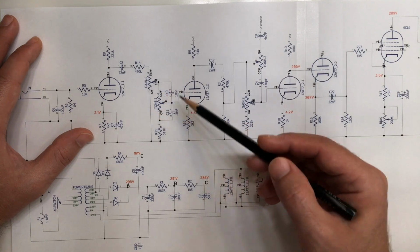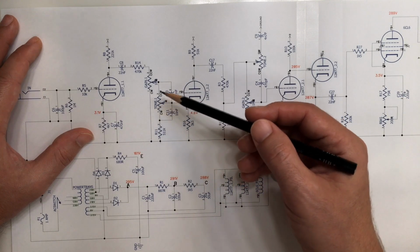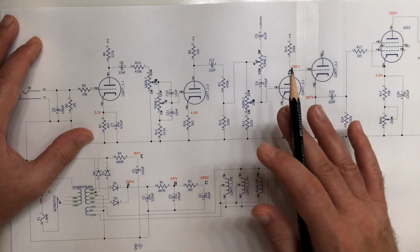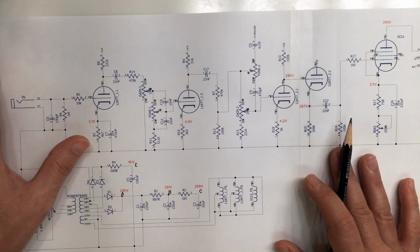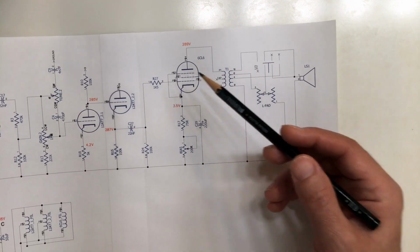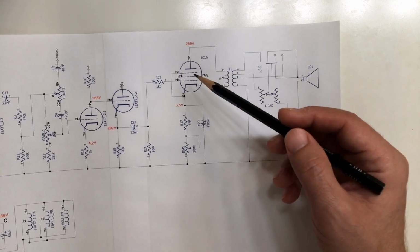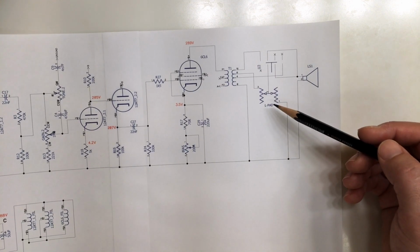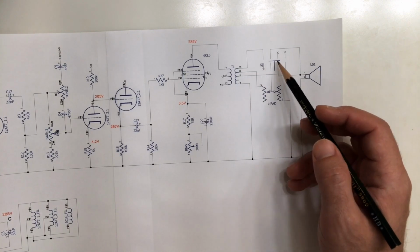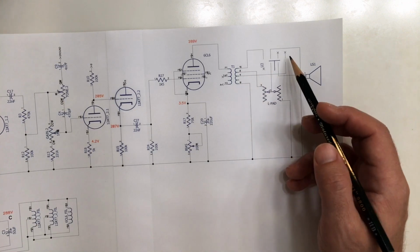This is done so that we can have a bit of a tighter sound by cutting some bass frequency earlier, and this is especially useful when you're using the amplifier on the quiet side, which you can obtain by using an L pad which dissipates the power after the power tube, so you can get all the warmness and crunchiness from the power tube but at lower volumes. The L pad functions only at 8 ohm, even though by using the switch on the back of the amp you can select between output of 4 and 16 ohm.